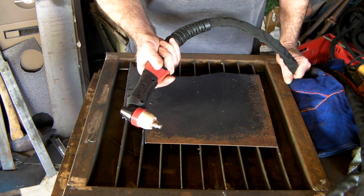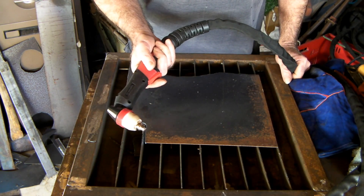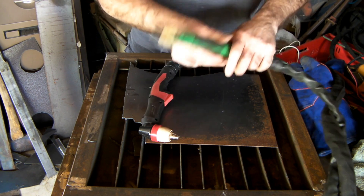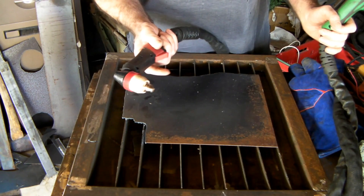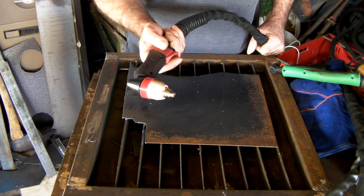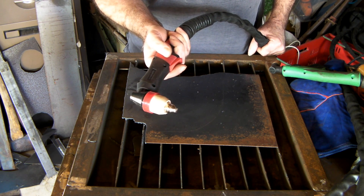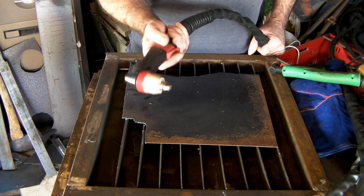If you're cutting a lot of crappy old metal, you're better with the pilot arc. I'll show you how to convert the non-pilot arc torch into something like the pilot arc, and also if you already have a pilot arc torch but you don't have a pilot arc machine — because you can buy these pilot arc torches for virtually nothing — I'll show you how to use that on your non-pilot arc machine as well.